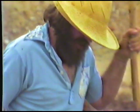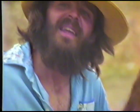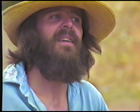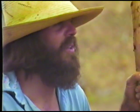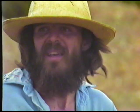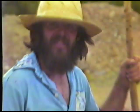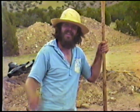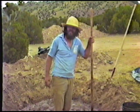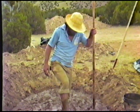Now what was that mix again? It was three sifted dirt, 1.5 straight clay, one sand, one heaping hay or straw, chopped up. And you say that changes from pit to pit and site to site? Your dirt will, because maybe you have clay in your dirt. Up in Taos, they just take the clay right out of the ground, and it's perfect. But this wants to be a little more clay than what you'd use normally in a wall, but not so much that it's going to shrink.